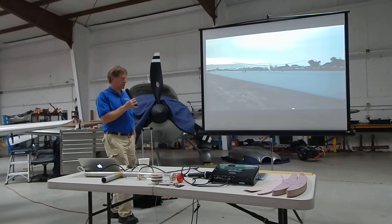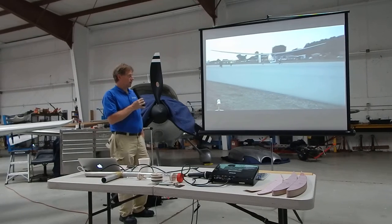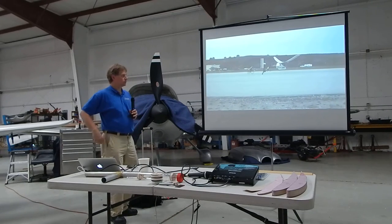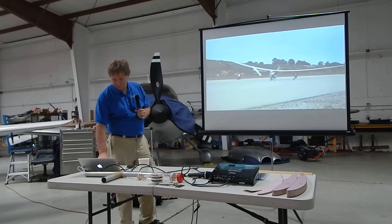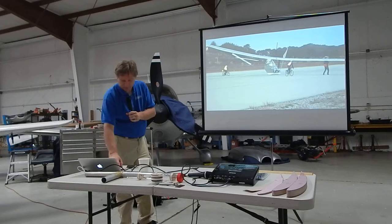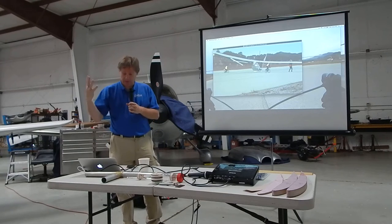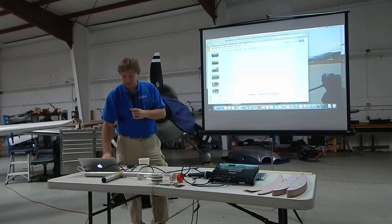This is the same flight from the outside. Here's where I really got into a PIO situation, and then I remembered what was going on and let go of the stick — you'll see it mellow out and actually become pretty stable after that. It's interesting how little effect the tail failure had on the flying of the airplane, because it's so insensitive to roll-yaw motion, and once that mount broke there wasn't any way to get tail moment back into the airplane. Since the tail was still attached, we didn't have any CG problem. So that was the first flight: 233 meters — a very successful first flight for a human-powered airplane.